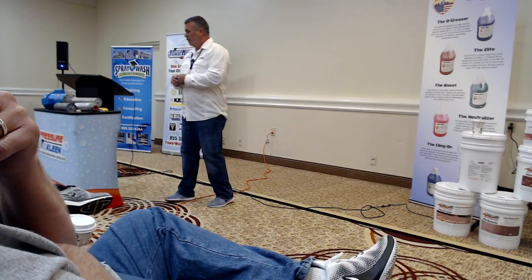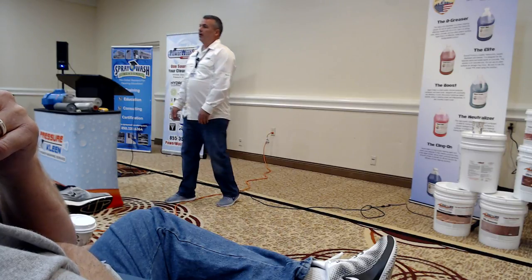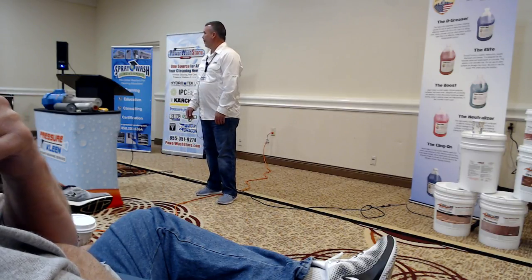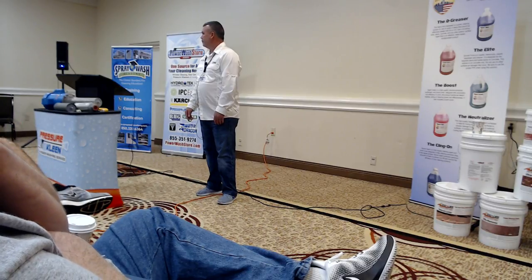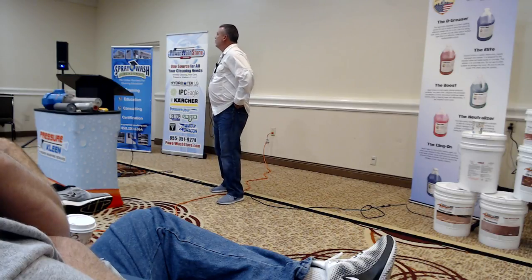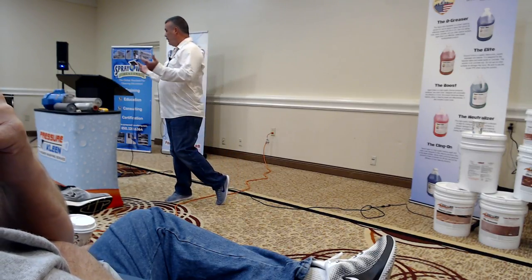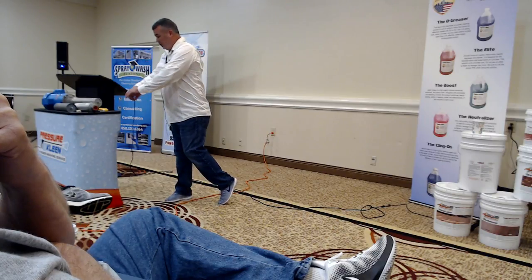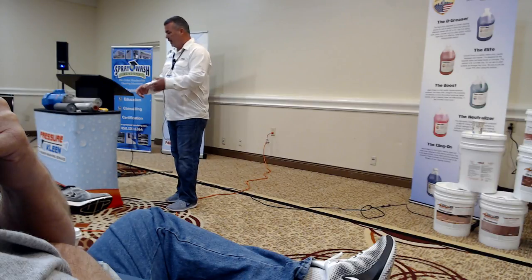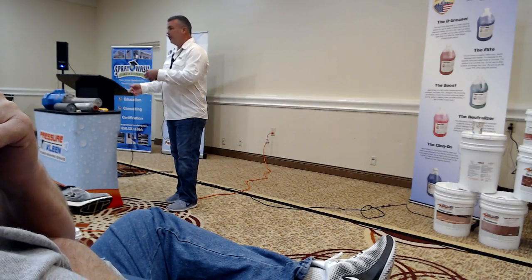Any more questions? Maybe one more question. When you run your hose pipe and you get started, it's a good idea to turn the water on at it before you hook up the truck. Oh, always. You want to run positive water through there. I let mine go, and this jumper, I just keep caps on it, and I'll just let it go until all the air is out. Then I put the cap on, then the pump is primed. I can run whatever I want through at that point.